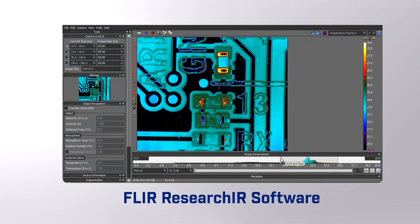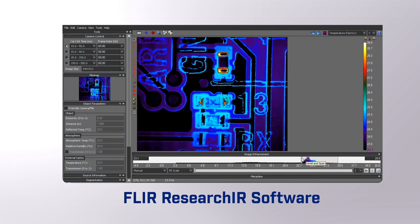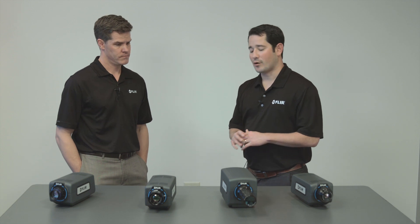Of course, they all come with our ResearchIR software — everything is compatible with ResearchIR. We talked about the gigabit ethernet interface and the CoaXPress interface. Everything has the ability to pump 14-bit digital data into a laptop or PC running Windows with our ResearchIR 4 software, which comes standard with all of our cameras. It is a true differentiator when you're talking about a scientific camera. We've got sensors pumping out data in all these different bands — but really, what do we want to do with that data? We want to measure intensity, measure temperature, do radiometry, and do true beam profiling. We can't do that with 8-bit data; we've got to take that digital data for real-time analysis. The engineering team has done an incredible job building these cameras and the ResearchIR software into something that is truly bulletproof.